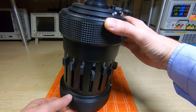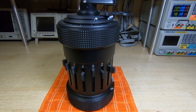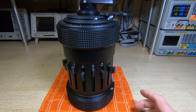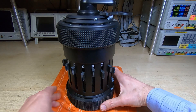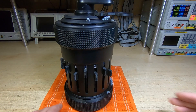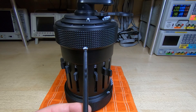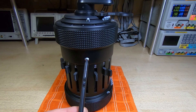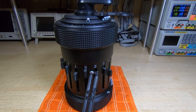I still have some work to do on this - there are things I need to modify and improve. That's not to say I'm criticizing what Marcus did, but for my personal preference there are a few minor changes I want to make. The first one I've mentioned already, and that is the issue with the reversing lever - the lever that reverses the operation of the counter. The lever wasn't going into the right place, so I've made a replacement shaft. I've printed two and this is just so I could show you the difference. This is the original, and hopefully you can see that the dimples on the one on the left are in a different place, and that puts the reversing lever into the correct location.